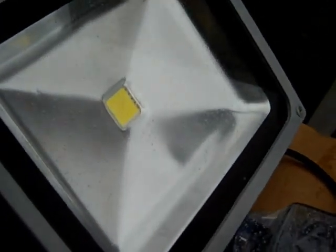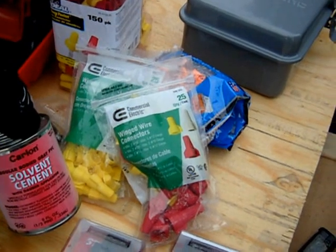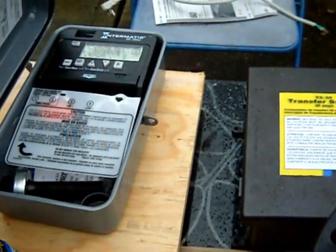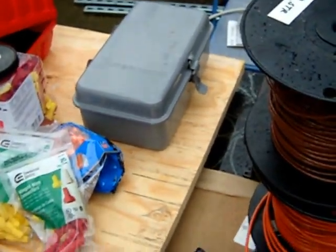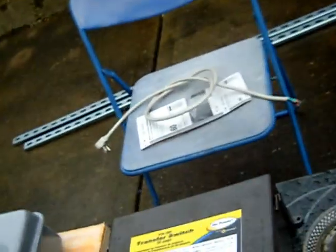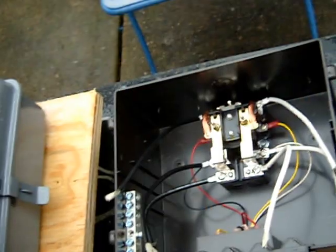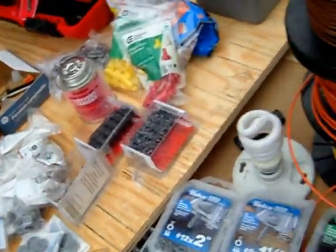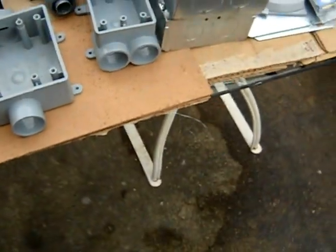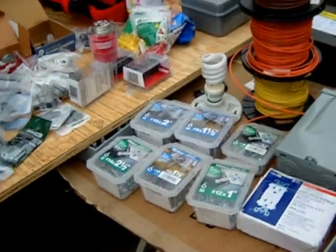Here's our load: a 50-watt LED ballast outdoor safety light. Solvents for putting the conduit together. And here's the cool part — a timer switch, which we'll want to use when this gets on the house so we can run the safety lights on the construction site at night. Also an auto transfer switch — about a $30 one from Amazon. We should in theory be able to run all the circuits for construction off a sub-panel fed by the inverter, with auto transfer to the line as needed if there are many cloudy days or insufficient battery capacity.